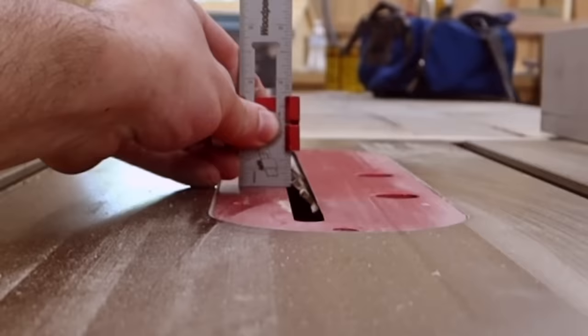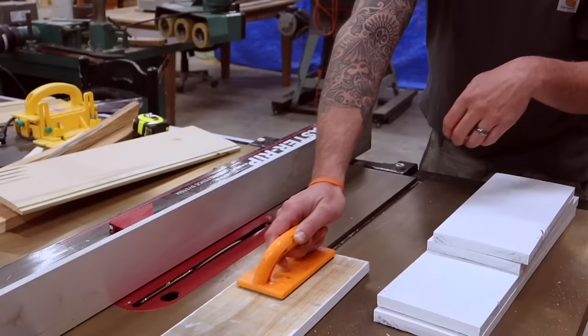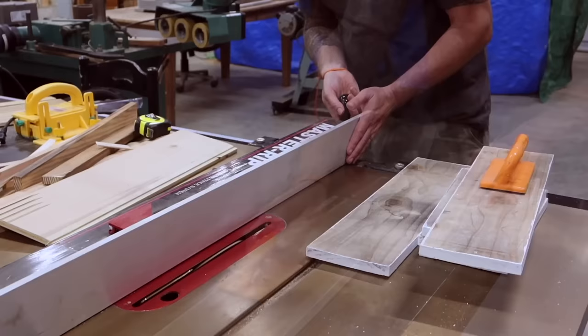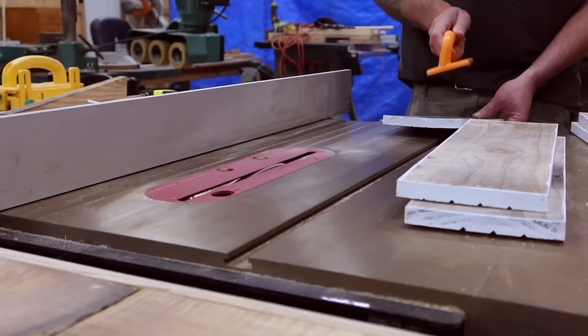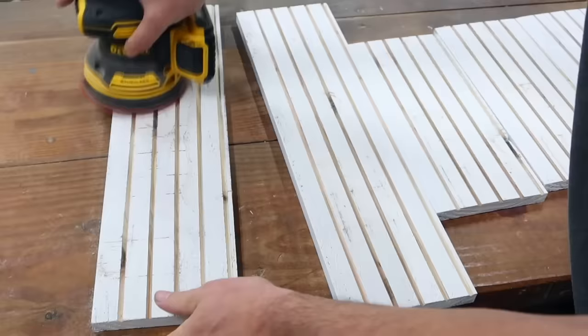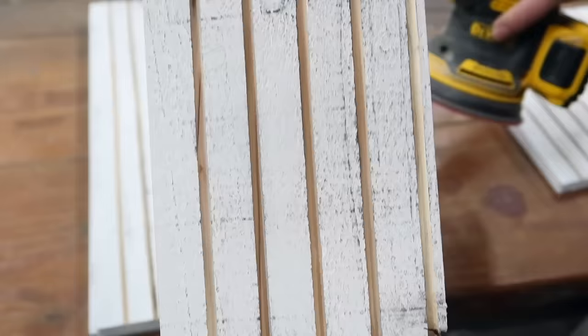I'm going to put my blade at a 45-degree angle and raise the blade up to one-eighth of an inch. With our fence set at one inch, we're going to run all of our parts through. I've left all my gables as a square or rectangle so I can cut my miters later — much easier to run through the table saw. Once we have our cut at one inch, we'll move the fence over to two inches and repeat this process, then move it an inch at a time until we have five siding slats. With this 45-degree angle it gives an overlap look just like siding. Now I'm distressing the material — just knocking off the top of the white so the black underneath can show through.